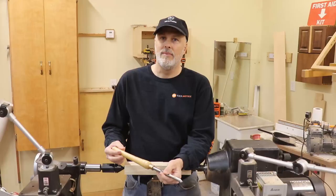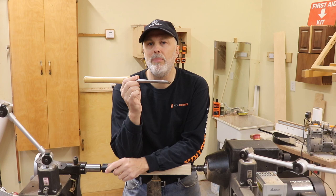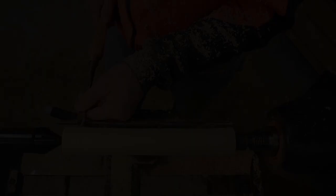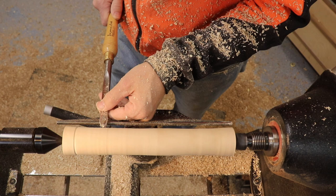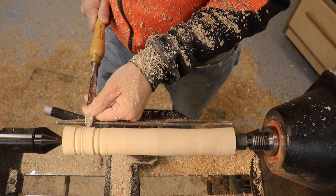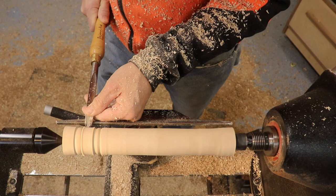Next up is the spindle gouge. I'm going to cover two spindle gouges — I like one larger and one smaller. The first is a half-inch spindle gouge. It gives you the ability to shape larger concave and convex forms, turn beads, and do gentle sweeping curves. This is a great tool for a lot of the shaping you'll do in spindle turning. I probably spend more time in spindle turning with a half-inch spindle gouge in my hand than any other tool — it's the workhorse. I love it for big sweeping actions, and it leaves a very nice surface finish as long as you have a good sharp grind on it.